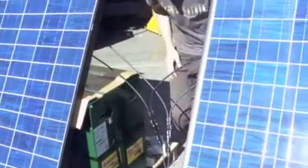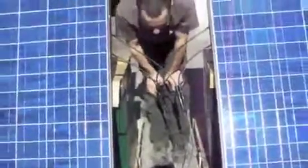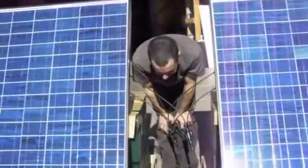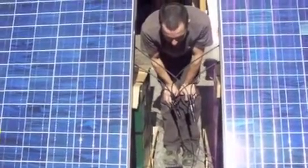Okay. What do we have here? 200 watts. Oh, 0 watts because the cameraman is standing in front of the solar panel. Oh dear. The shading has taken effect. Okay. Come on in closer, I think. Alright, back up to 200 watts. Woo. And we have 14 volts, so we're getting a good charge going into the batteries.